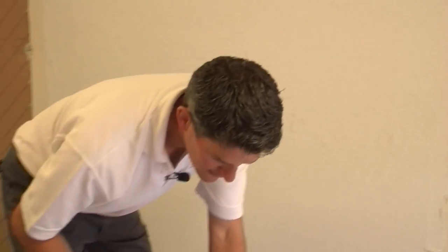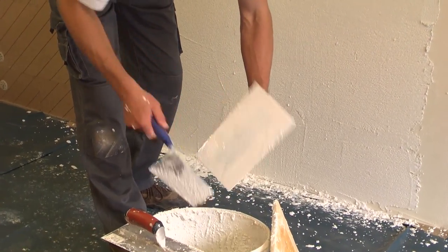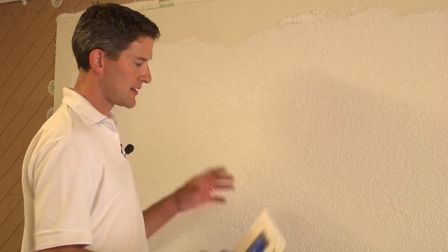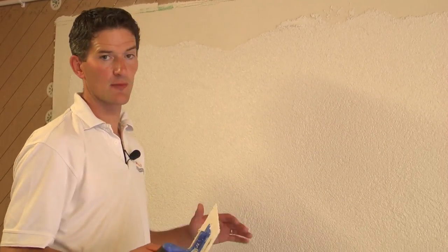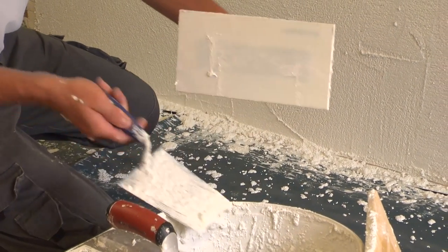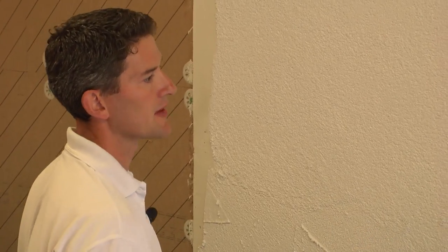When it's beginning to drag again, scrape it down and scrape all that material back into the bucket. I tend to work from the top down with the rubbing up simply because the extra bits tend to fall down. If you work from the top down, you're touching up any extra bits that stick to the wall below. The person doing this really wants to bring a tub of render with them so they can scrape the excess off the trowel into that bucket, as well as anything that drops on the floor.